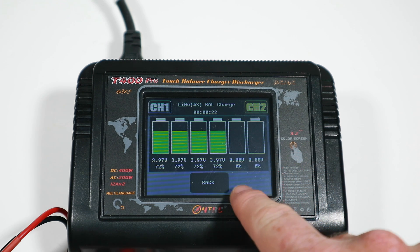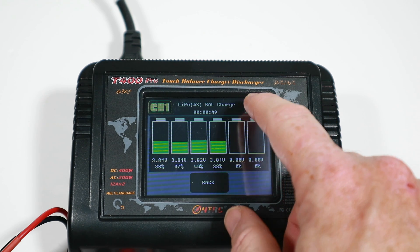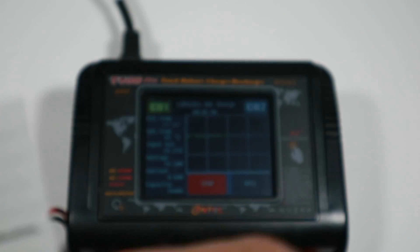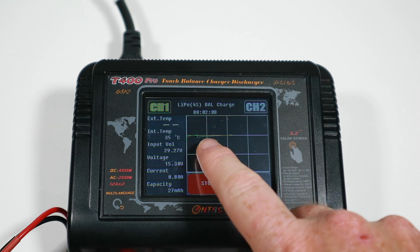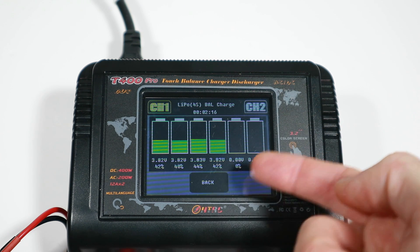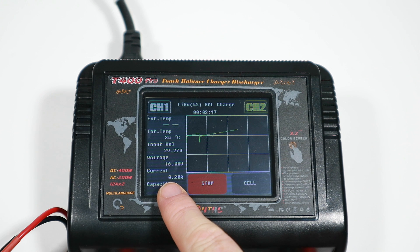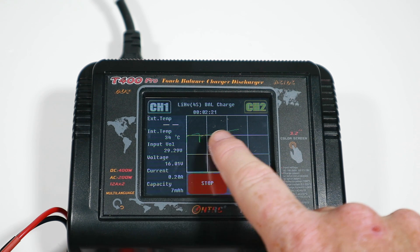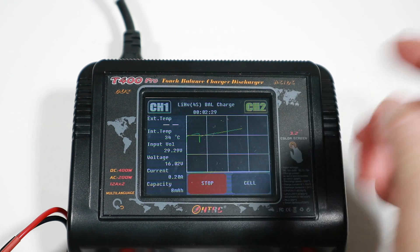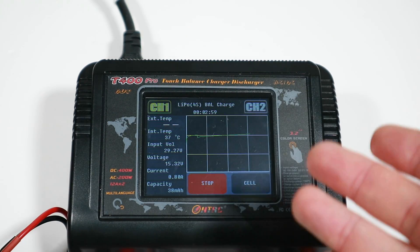This pack looks like it was already charged a little bit higher than I'd like. Channel one cells are at 3.8 because I put them at storage - a slightly obvious thing to do. There's a graph on screen and I'm not sure what it's supposed to tell me. I had a look at the manual - it shows the picture but doesn't really explain what it represents. I don't know if it's temperature; it kind of looks like it might be, but there's no scale anywhere, which isn't particularly useful. The important info is the current being put in and how many mAh it's added, but if it were colour-coded somewhere it would help. I just can't tell - is that empty and that full? I guess we'll find out at the end.